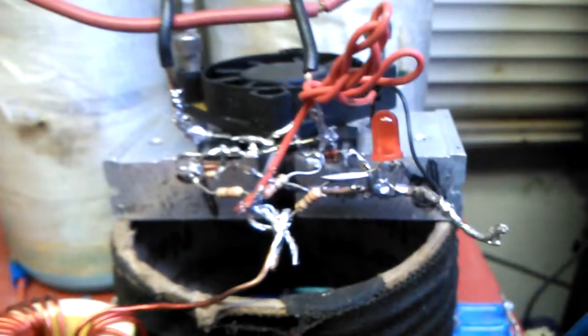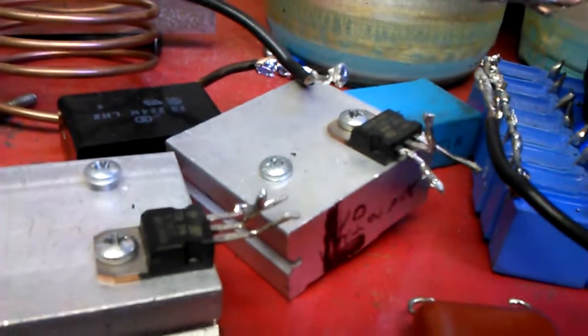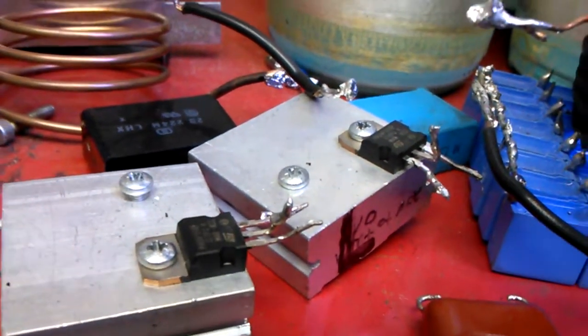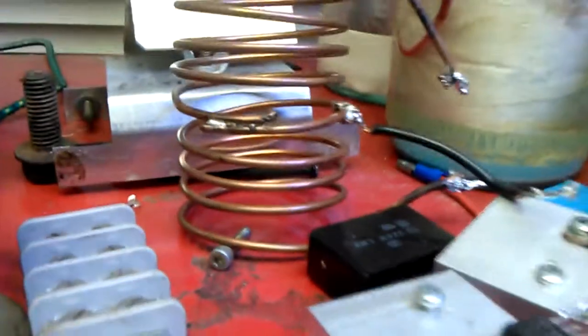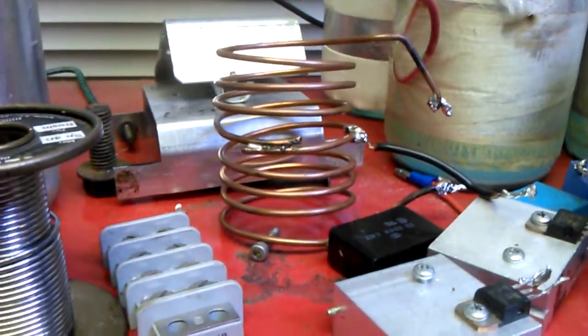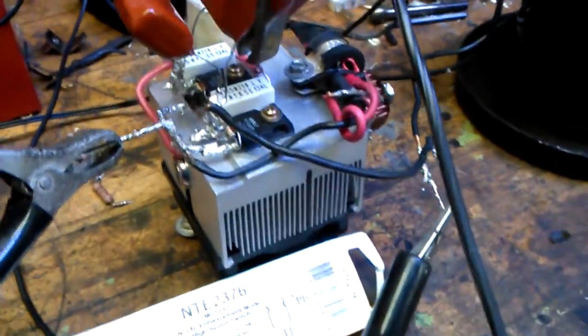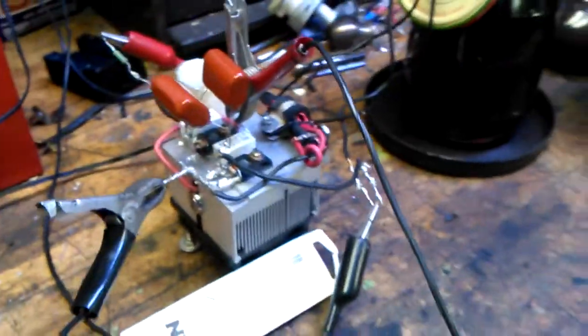These are audio caps — I like the bumpity bump — but I also have other uses: keeping DC voltage smooth on my miniature ZVS driver, which will be paralleled soon because these survived the last run when the zeners didn't. Maybe the next video will be induction heating where I can melt some stuff for you guys. I think I've already pushed about 400 watts through the last one before it died of heat.